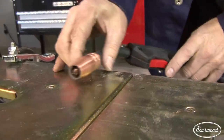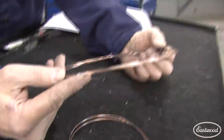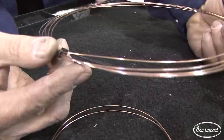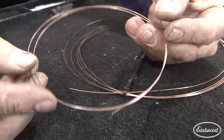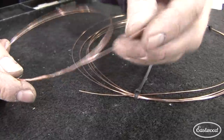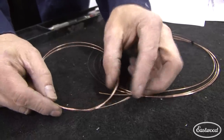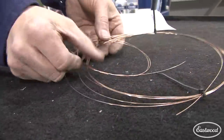We've got two different grades of wire here: 30 thousandths (.030) and 24 thousandths (.024). For sheet metal, it's better to go with lighter wire. The lighter wire doesn't add as much filler because the solid core wire isn't as thick. Because there's not as much metal, there's not as much heat — not as much electricity needed to melt it. So your heat-affected zone and your weld pool are smaller. A smaller gauge wire works better for sheet metal.